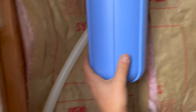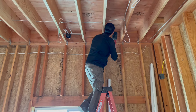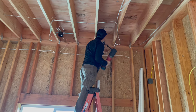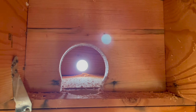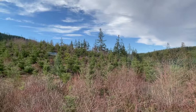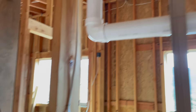We still have to cap off the sprinkler head. We're drilling out for our vent lines out the front of our PEX. Just going to go straight out right there. Okay, we've got our pipes capped off and got Teflon tape on our clean-outs. As soon as we get the vent lines glued up and run out the front, we will be ready to pressurize the system.